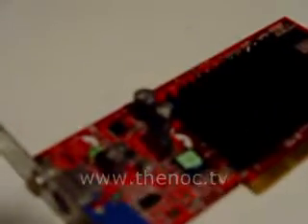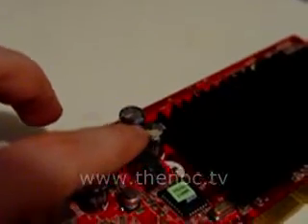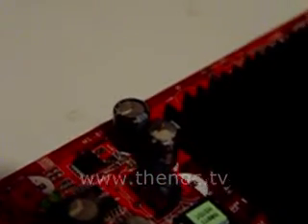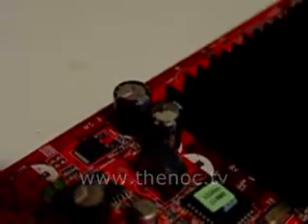I'm going to try and zoom in here because I want to show you what a blown capacitor looks like. This little guy right here — you see that brownish color right on the tip of that. There we go, that's better. That's a good capacitor; that's a bad one. It just blew a little bit, so this card was kind of working. If I turn it here, you can kind of see that little bulge on top of it. That's what happens when a capacitor goes bad — they'll bulge up, they'll pop, and that brown stuff you see is the actual substance inside leaking out.